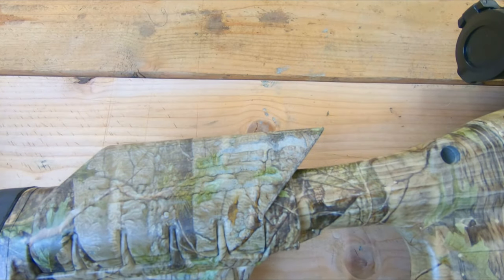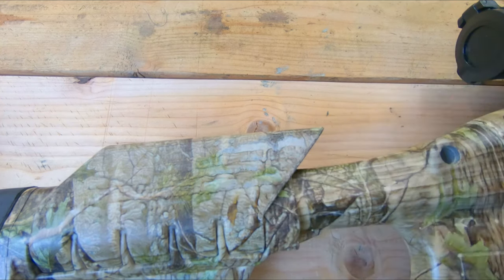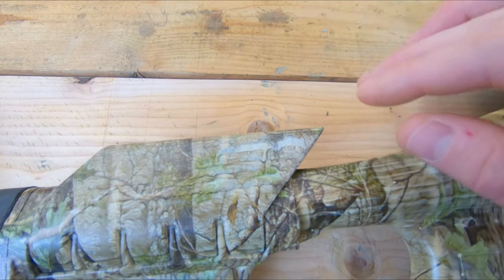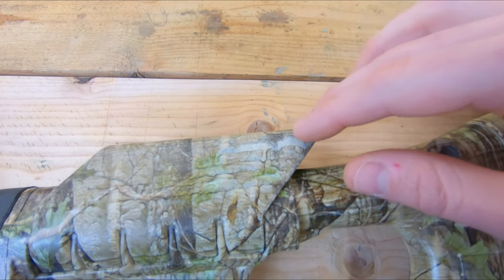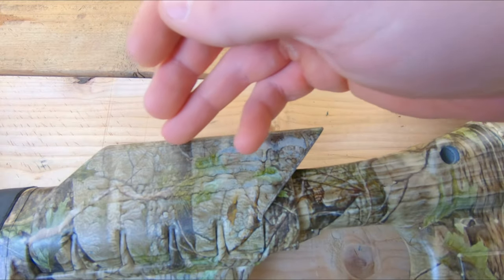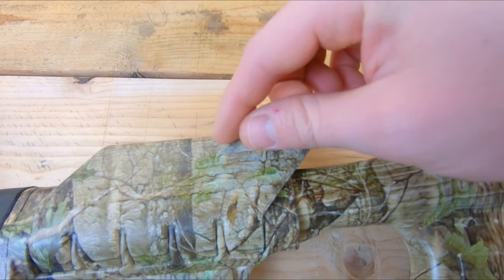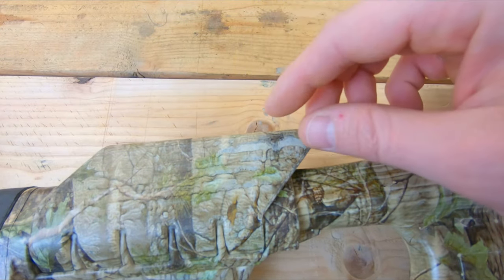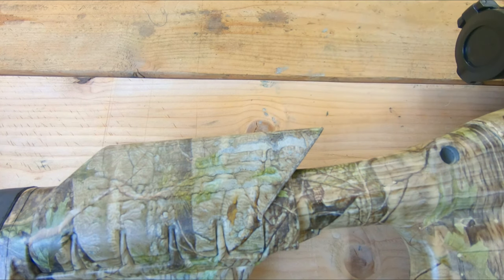One other thing I had happen quite a few times, you can see here, this weird blemish, and what this was: the dip would look perfect after it was dipped, and then I would come up to rinse and the rinse would actually start rinsing the ink and some of the base coat right off of the part. After doing some research, it looks like there could be a couple of reasons for this. One, maybe I didn't lay the base coat on thick enough, so when you dip the part, the activator can start to cause the base coat to come off a little bit. So it's possible that going a little heavier with the base coat may have fixed this. But one thing that I did learn that resolved this was, instead of immediately going to the rinse, letting these parts hang for 2 to 5 minutes and then going to the rinse. I didn't notice it happen nearly as much.